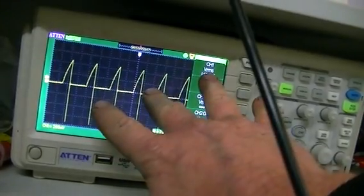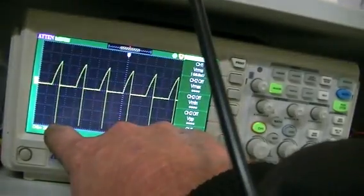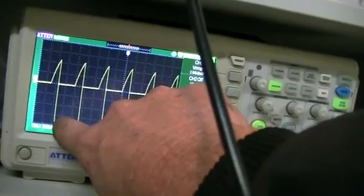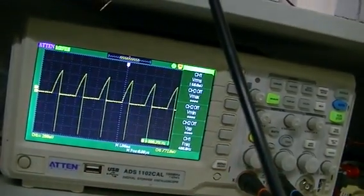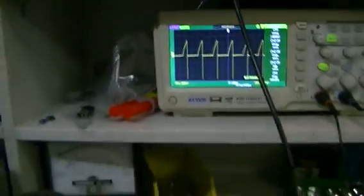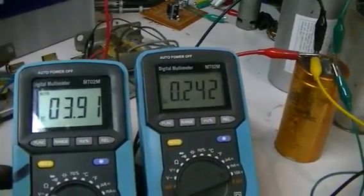Here you can see our inductive kickback - or as it should be called, inductive kick-forwards. Normal situation: power on, switched off, flyback. Now the reason some of you get confused and see it going the opposite direction - that's not the current, that's the voltage. The current continues to flow through the inductor in the same direction; the voltage inverts.